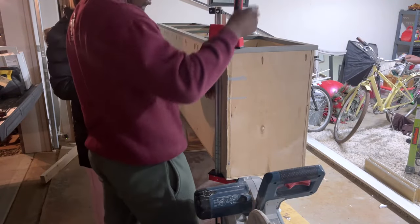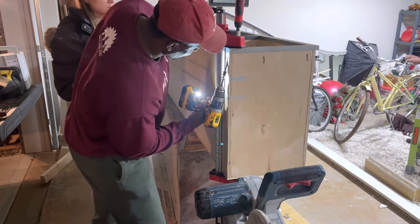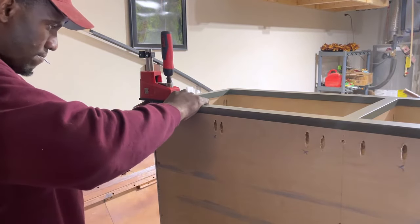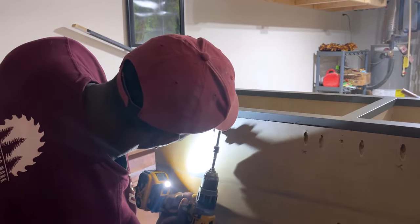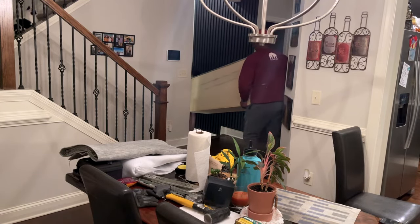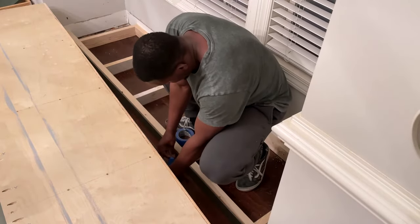I've seen other guys install cabinets with a towel between the face frame and the parallel clamp — I've never done it before but I'm going to start doing that so I don't damage the face frame. Once I have the position of the face frame, I screw in using the Kreg pocket holes drilled earlier. The X's you see were a mistake — I didn't adjust the jig size so some holes are at half inch instead of three-quarter inch, so I marked those so I knew where not to drill. Then we muscled the carcass in place — getting it inside was fine, but getting it into the nook we thought we'd have to destroy the whole project.